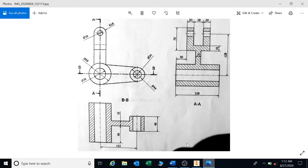We'll be looking at this drawing to apply double extrude. The shape shown is the most appropriate to draw. These are sectioned views: this view is on section line AA, and the view at the bottom is on section line BB — you can see the arrows pointing downwards towards the section. Let's analyze the drawing. I'm going to draw it first and then explain my extrusions.